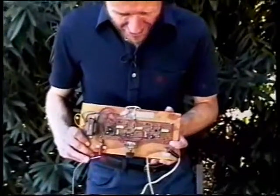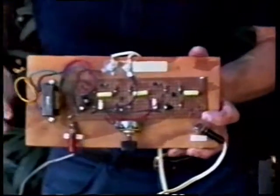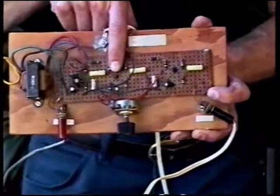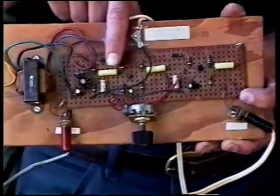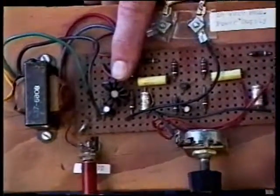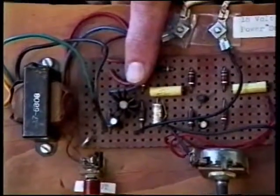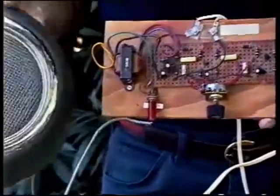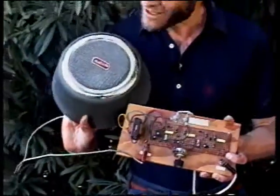I wanted to show you how I was getting so much noise out of an all-band crystal radio. As you can see by looking downward, this is my three-stage amplifier — it consists of a transistor here, a transistor right here, and another one back here, each a stage. At the very last stage I have connected a transformer, and from this transformer I go to my old-time speaker, and that's where you heard the sound.